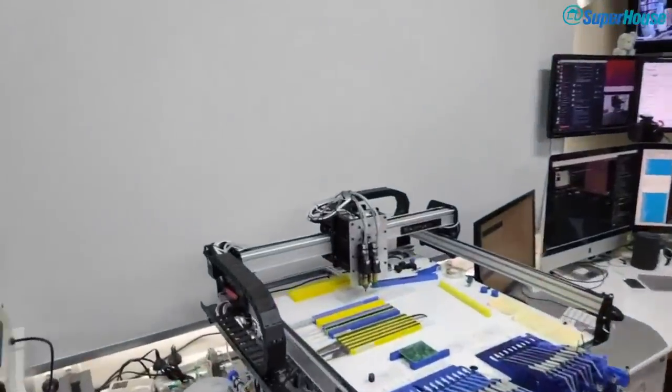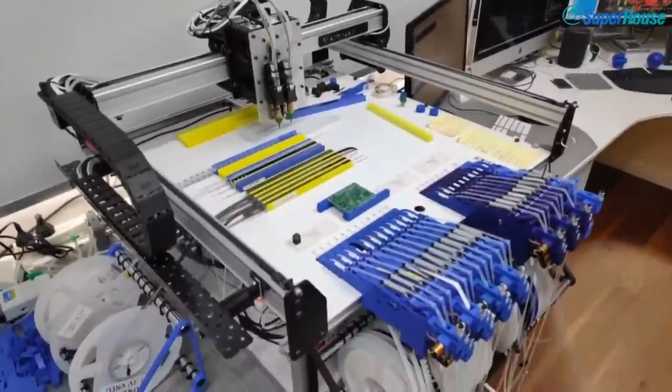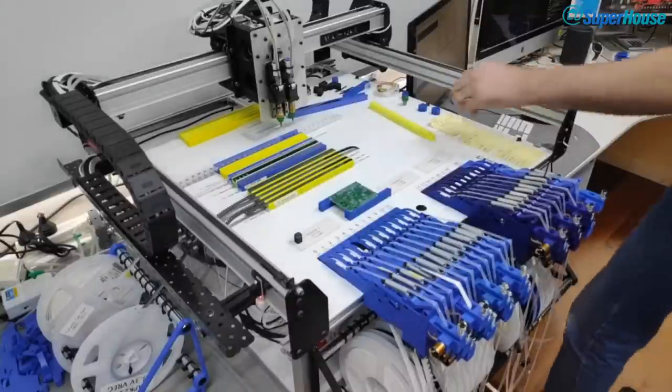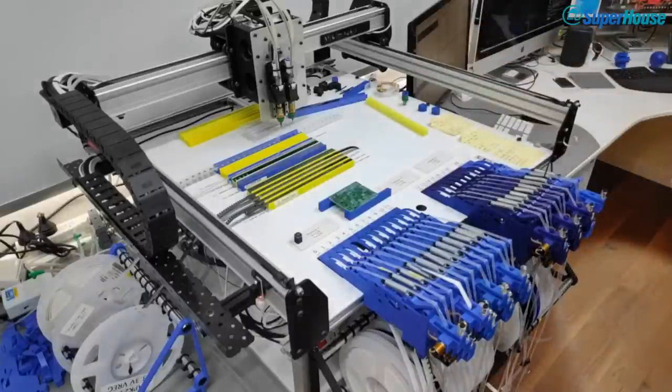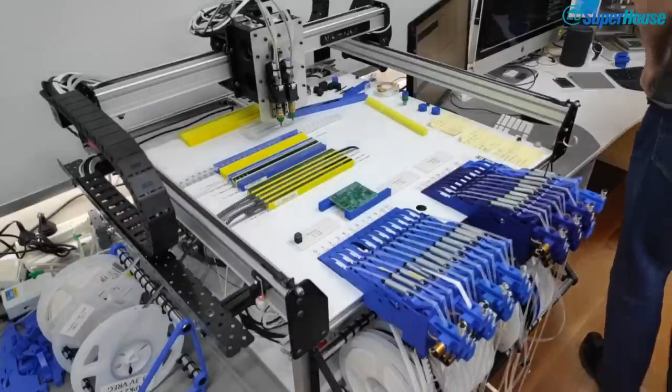Because the pull-ups and pull-downs are weak, if it experiences a lot of external electrical noise, it can possibly boot up in an undefined state, where it might see one of those pins as being asserted when you don't want it to be. So what I did was explicitly add resistor networks to bias those pins. That was a very long-winded explanation.